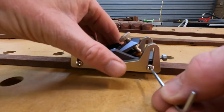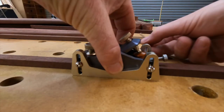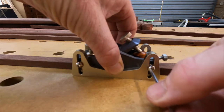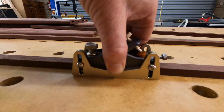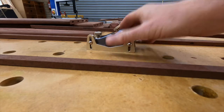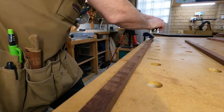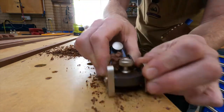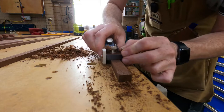These look good - excellent. This presents the perfect opportunity to use my Bridge City block plane as a thicknesser - its first real-world usage really. What I'm doing is setting these little side gliders or runners to the thickness of this piece of wood beneath it, so I can then transfer that thickness over to the other pieces of timber and they'll all be the same thickness. Man, I love this plane - this is quicker than firing up the thicknesser, it really is.